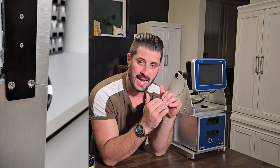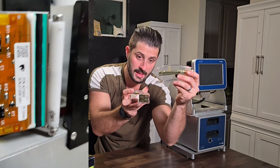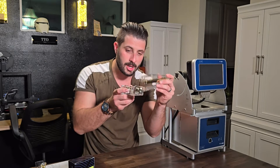Number two: the printhead and your peel arm. Grab your printhead and just move it down, looking for any interference. In normal operation the printhead will clear the peel arm every time, but these peel arms tend to bend. If the printer is set face down, the whole unit sits on top of that peel arm and it gets a slight bend. When that happens, every time you go down to print you'll end up hitting it. Look at the roller — sometimes it's obvious, sometimes it's not, but watching that roller rotate can help you identify the issue.